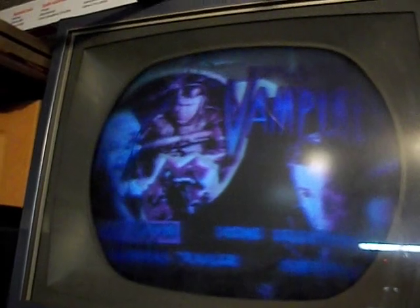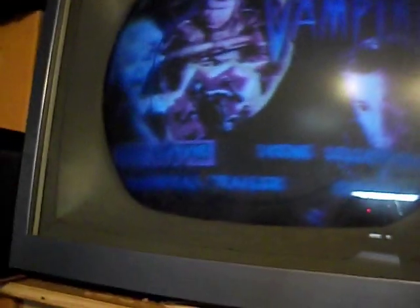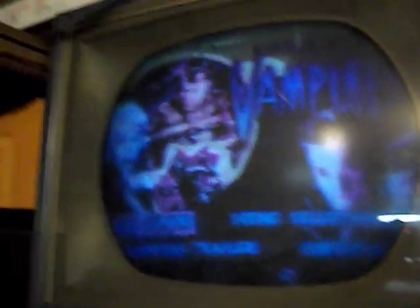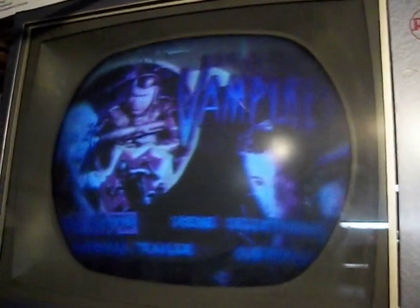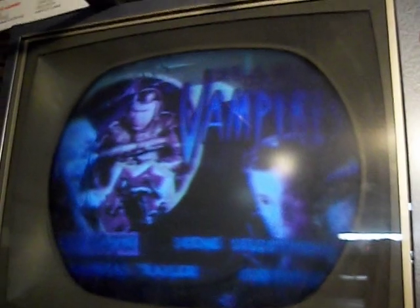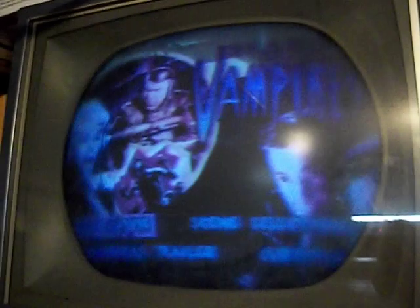I can't really complain. All the colors are demodulating properly. It's really blurry, but the focus is definitely working. I don't know how much of that blur is due to the dirty, uber dirty safety glass screen — the bonded surface is pretty dirty too. This CRT has been used at least a week after the rejuvenation and it seems like it's holding pretty well. I have pretty high hopes that the rejuvenation function in that CR161 is not half bad.